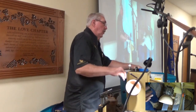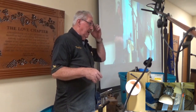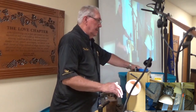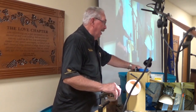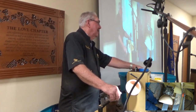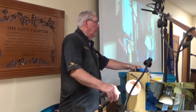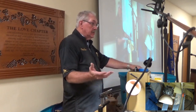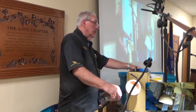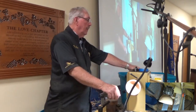Well, they say most finishes, once they've cured out completely, are food safe. I wouldn't trust polyurethane myself, but I guess you could if you want to. I'm not going to try. Most people are afraid a finish will poison you, but they've determined that it won't. Once it cures, any finish is good. Polyurethane might take 7 or 8 weeks to totally cure out though. So don't put a coat on today and think you can eat out of it tomorrow.